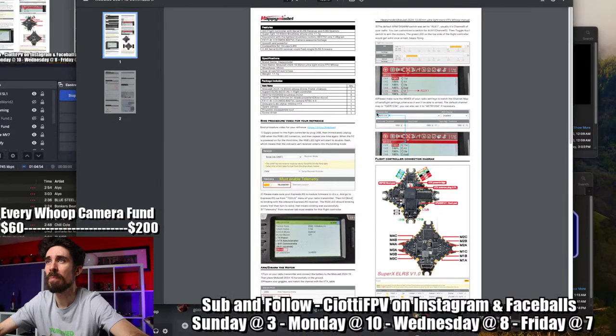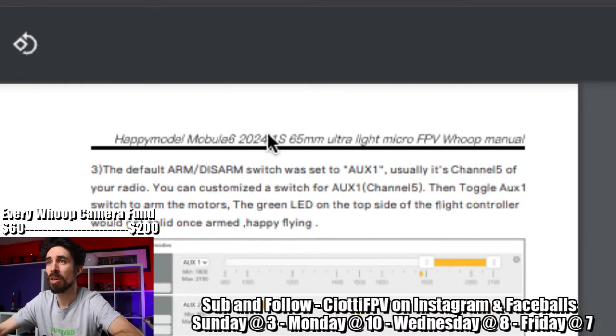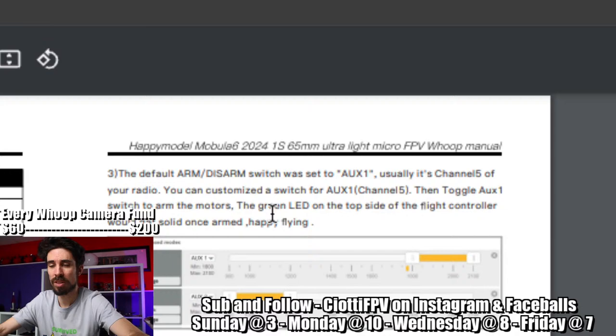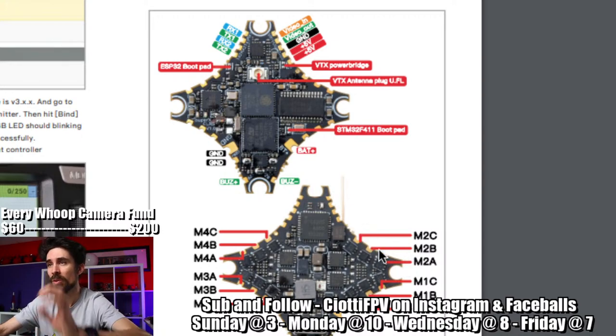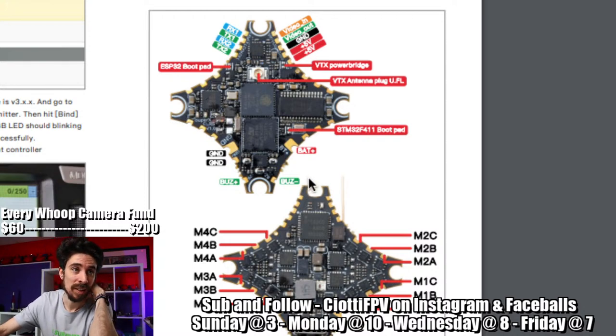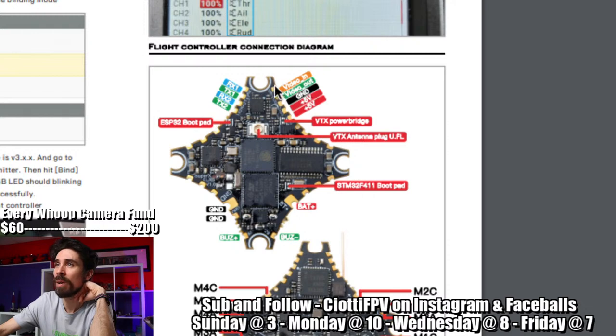All right, so this is what kind of tipped me off. Apparently this is the instruction manual for the new Happy Model Mobula 6 2024 1S Ultralight. And this is what tipped me off to no motor plugs whatsoever. And what I think we've also just learned, thanks to Troy Prelog, and I am confirming right now, yep, is that there's no plug for the camera. So the camera will need to be direct soldered as well. Obviously, it will come with a camera direct soldered, and it will come with motors direct soldered.